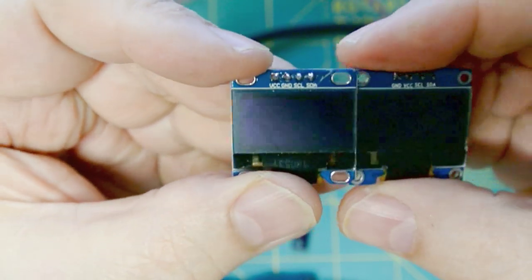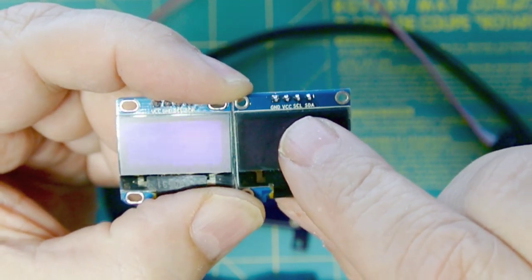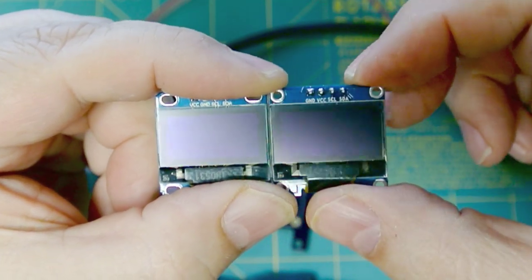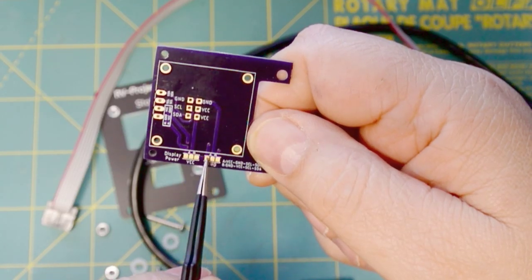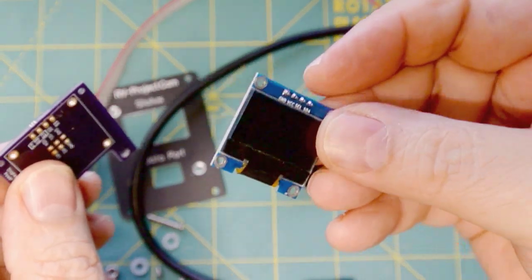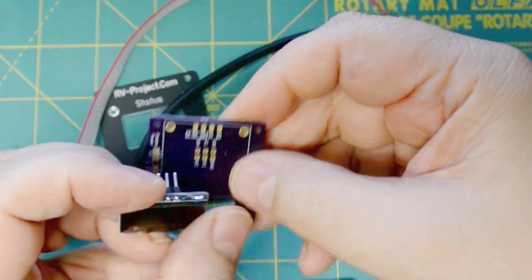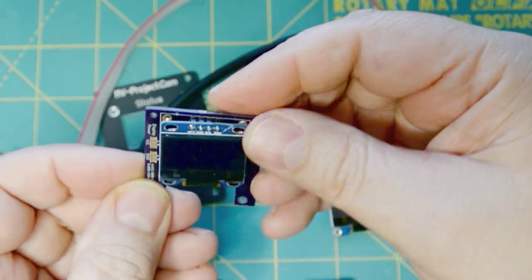If you look at this one, it's a little bit different — this says ground first, then VCC, and then SCL and SDA are in the same two positions. So when you buy these, you're going to find some that have the 5-volt positive and ground reversed. On this circuit board on the side we have some little programming tabs — this one says VCC, this says ground. These little pads will allow you to adapt this board to the various different wiring schemes of these little display units. And on the back side, this is just a 6-pin header that just goes in there like that — that's the only thing that goes on that side. And the OLED display just goes on here like that. I wouldn't solder this until we assemble the thing completely.